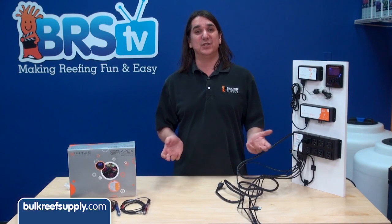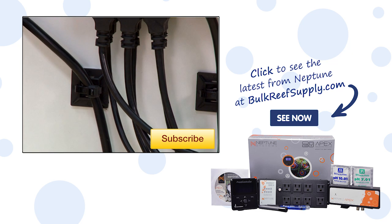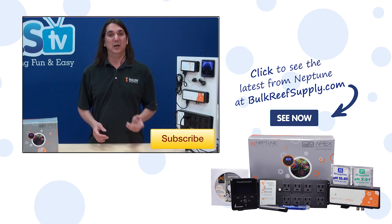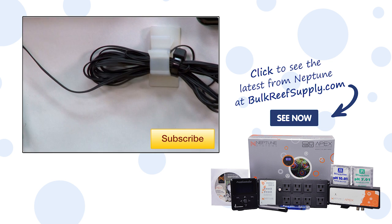Lastly, neatness counts. Something that looks neat is typically safer as well. Use of mounting boards can make routing cords and installing permanent drip loops much easier, not to mention it looks slick. These flat plastic adhesive tiles called mounting bases use zip ties to attach cables and can be found at basically any Lowe's or Home Depot. For probe cables or anything that may need to be moved at some point, these adhesive ratcheting clamps work well.